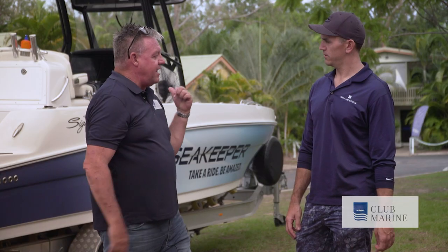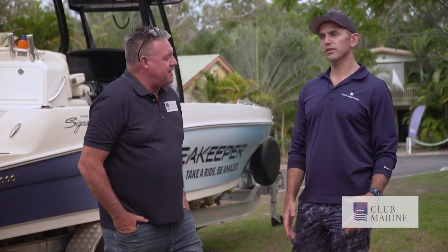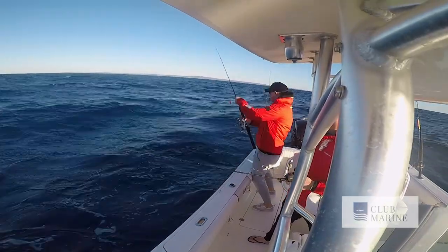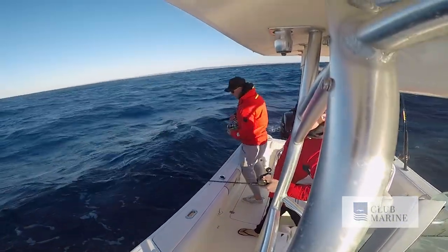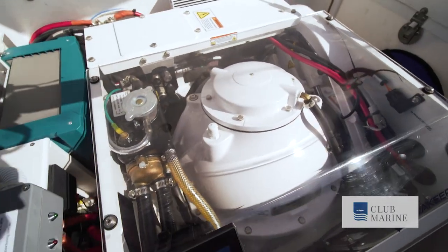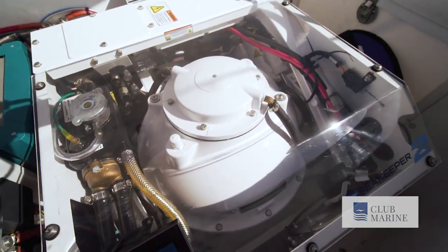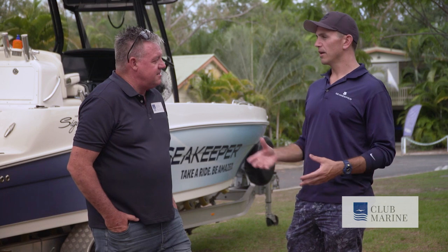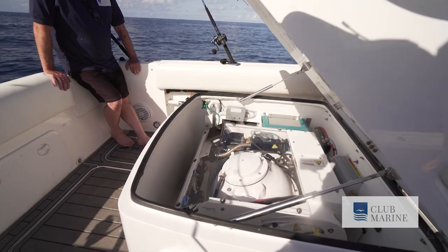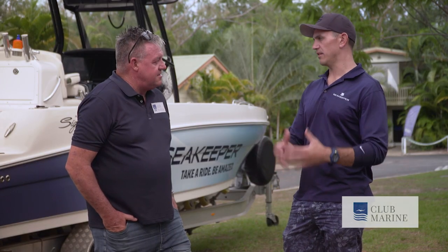The Seakeeper went into this boat under construction — but what about retrofitting a current boat? About 30% of our market is actually the retrofit market. A customer will go out, buy a monohull, and find that they get seasick, then come to us to fit a Seakeeper. We definitely take on a lot of retrofit projects. On some installations we can simply glue the gyro to the deck, and on others we put the gyro into the structure of the hull underneath the boat.